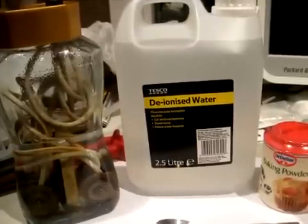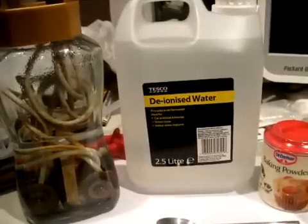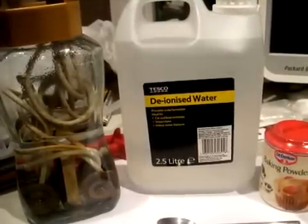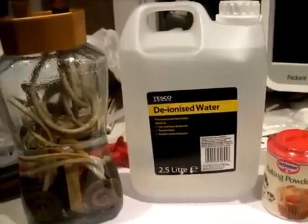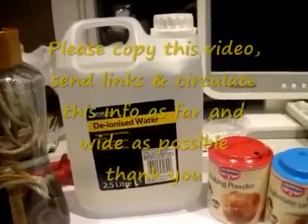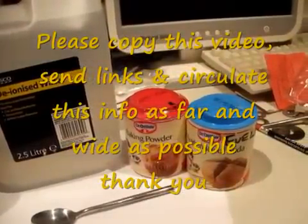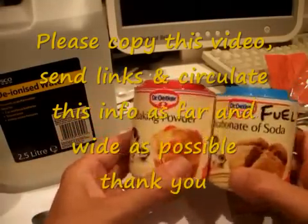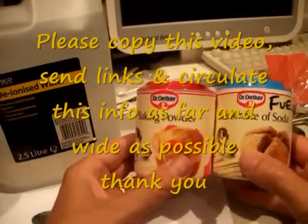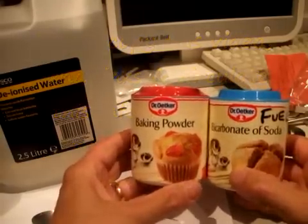You may find that the jar will need a clean out once a week depending on mileage. I've found that for roughly 200 miles I used about half an inch of water. You need to be aware that the more baking soda you mix will give you an increase in amperage draw, plus heat, plus increase in gas production. So a happy medium mix is required and will vary depending on your device and car's characteristics. I've also found that the warmer the cells get the more gas is produced, and an increase in revs from the engine increases alternator amperage output which also increases gas production.